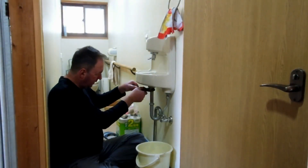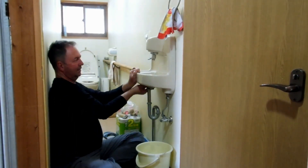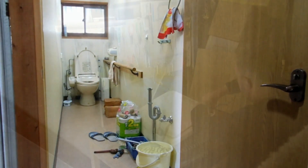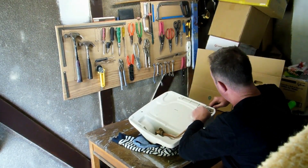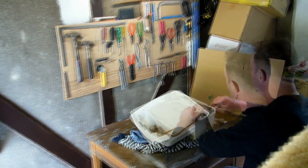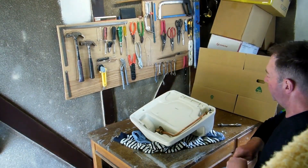We now have three places we could potentially wash our hands. Two hours later, noticed a big puddle of water on the floor. This is one of those jobs that gets worse the more you do it. It turns out that somewhere inside that unit it was leaking, so I had to take it off the wall and take it to the workshop to have a look at it. The fitting there is ridiculous. The fitting at the top to the left is a good one, and the rest of the fittings on the wall were good. But where it joins in here is just a dodgy plug-in type thing with no real fitting - it just sort of sits in there. The male has a rubber grommet around it, goes into a female fitting and just sits there. Just not adequate.